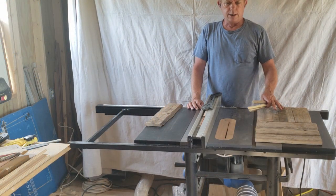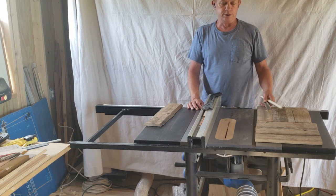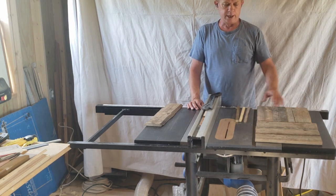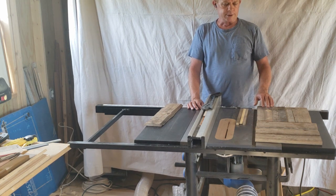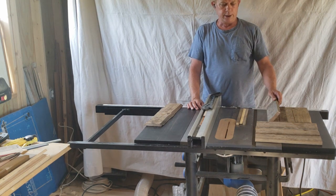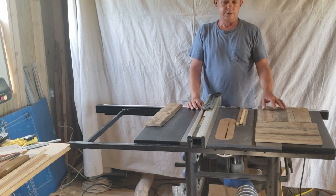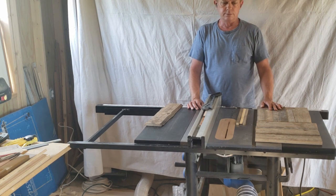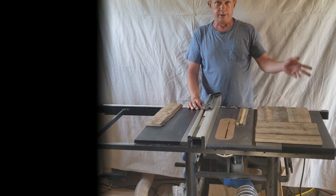When I was laying out my side pieces, I realized I did not make sure they were exactly 12 inches — I made sure there were at least 12 inches. So I did run through some of the larger pieces on the outside to get them all to exactly 12 inches. What I've decided to do is, before I put anything together, I'm going to sand the outside of the side panels just so I don't have to worry about it when it gets all put together. I'm not going to do a lot of sanding, but I'm going to do enough.